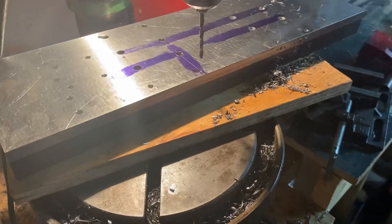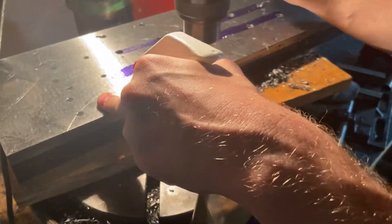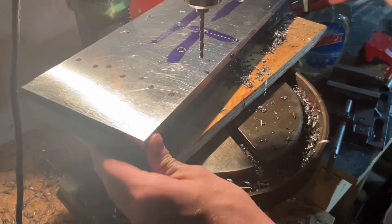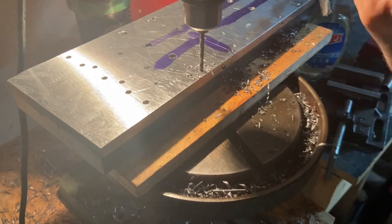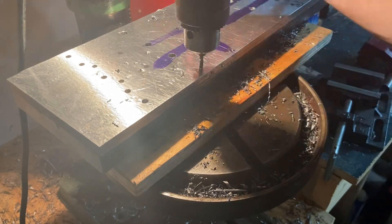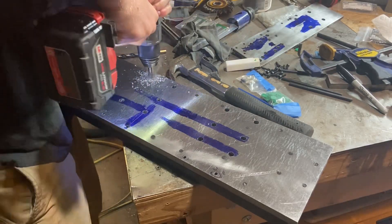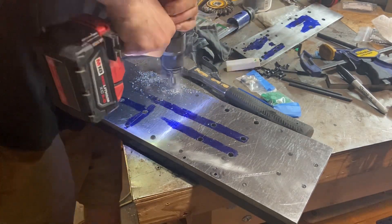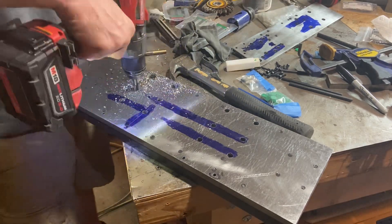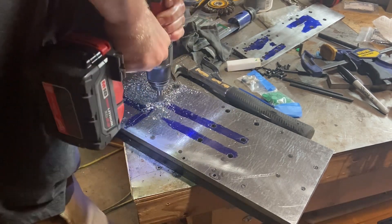The main reason for this is just because I was starting to run out of room, but it's also nice because then these bolt heads will not be underneath the linear rail on that side, so if I have to undo them for some reason I can do that without having to take off my top layer of linear rails. I kind of wish I did this on the other side too, because those bolt heads actually are underneath the linear rails — the row that you're seeing me drill at the top there — but for now I'm just sticking with what I've got.